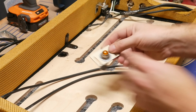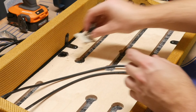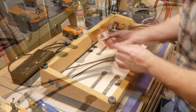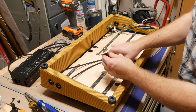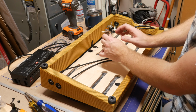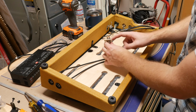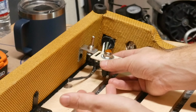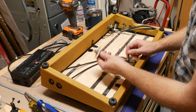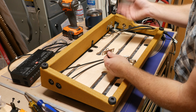So here you go, made a little mount out of some plate steel, a real thin plate steel that I found. That's it. We're just going to pop this right here and screw this guy in, and that'll be our undermount light. It's supposed to be mounted flush like this. It's actually meant to sit like this on top of the deck, but the problem is you can see how high that protrudes on that plate, which would be the pedal deck. It gets right in the way of any pedal, so you either have to carve out real estate to put a master switch and this guy on top of the deck, and you can't put a pedal there. Or what I've been doing is undermounting them, just something like this. So the light, if you cover it with a pedal, it doesn't matter. And the switch, you could still turn the board on or off if you want to, and it remains there functionally. But it doesn't take up real estate on top of the board.